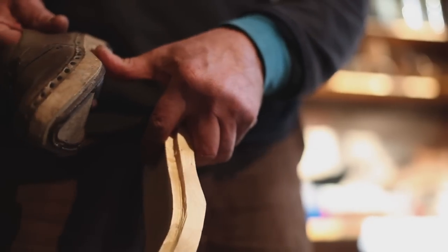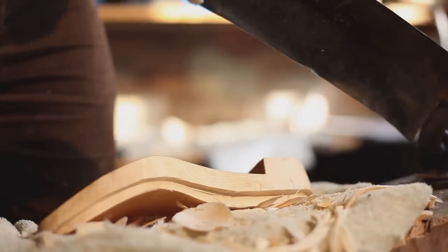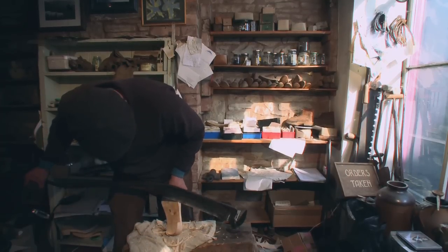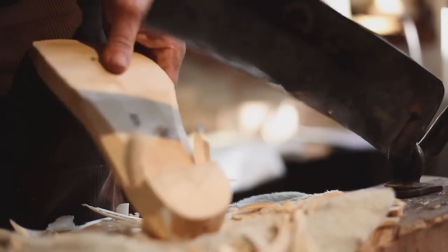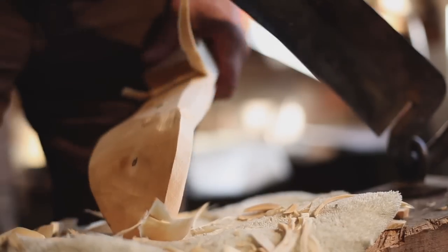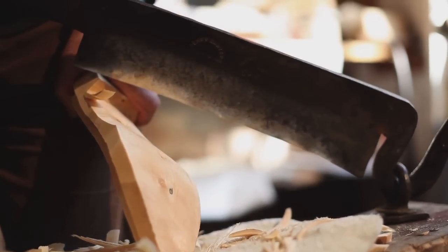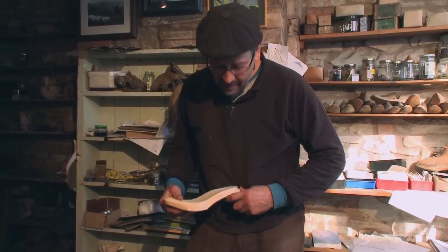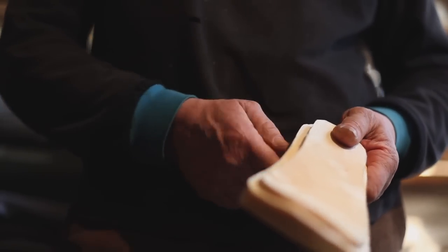On these I've just chamfered this — I always chamfer this, it's something I do and the clog makers don't. Just to make it a bit neater and to make it look a bit lighter, you do this and that. You're taking a bit of weight out, which is a pathetically small amount, but there is one good reason to do it: if this catches, it's less likely to split the wood. Because you've just put a chamfer on it there, it seems to be more resistant to splitting a chunk off.